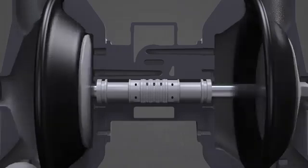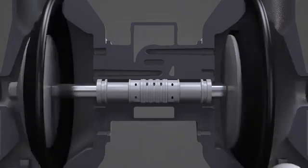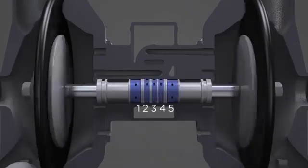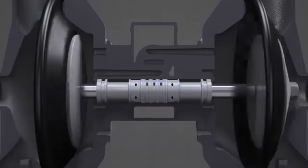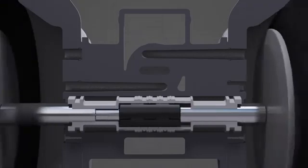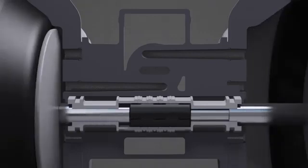The pilot air valve directs the air that moves the main air valve. It is constructed of 5 separate chambers and a central rod that moves side to side due to the diaphragm pressurizations. The pilot and main air valves work together to drive the pump. The pilot air valve has 2 logical states, which we will call left and right.